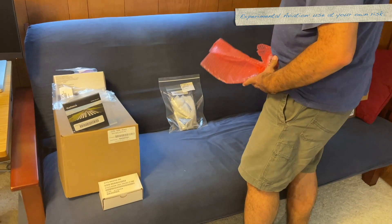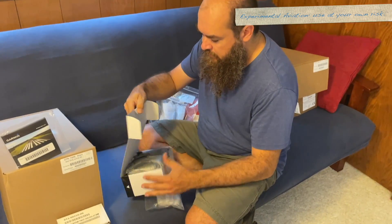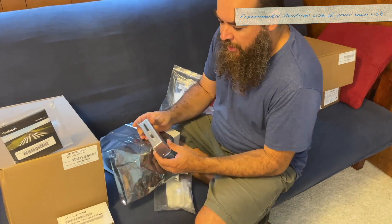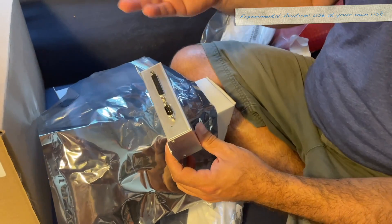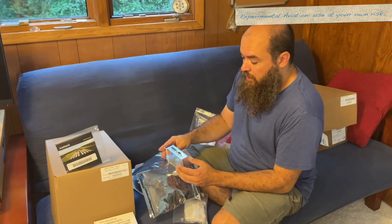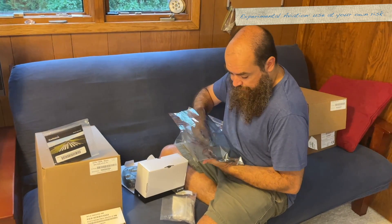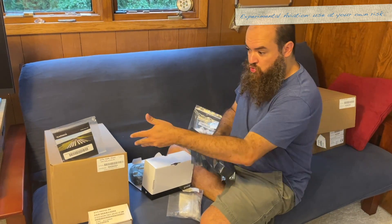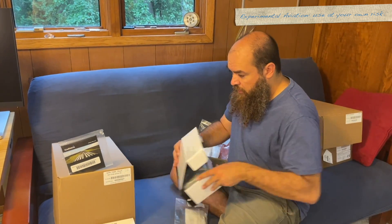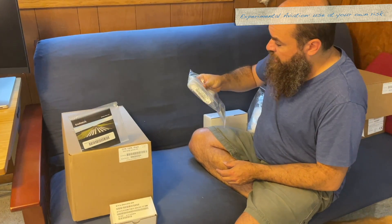Connector kit for the GAT-29. The GAT-29 is the ARINC converter box — it converts ARINC 429, which is a big-airplane aviation protocol, to CAN bus so the G3X system can see it. ARINC 429 is a very common big-airplane aviation protocol running a lot of avionics out there. It didn't make sense for Garmin to create a new GTN box just for experimental, so they're using that standard protocol and there's a converter box. This is the same for pretty much any brand of avionics navigator — they will use 429 and then you'll have a converter box. Connector kit for that is just a couple of little connectors — two connectors, no big deal.